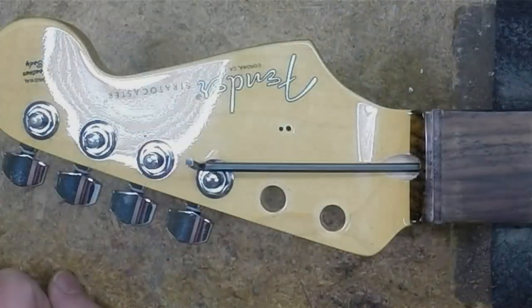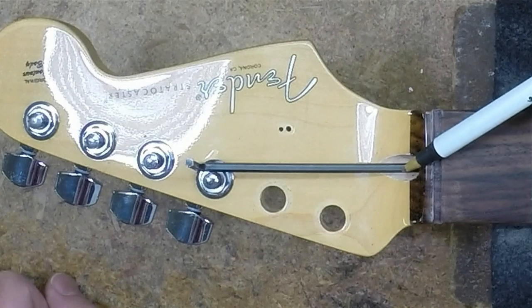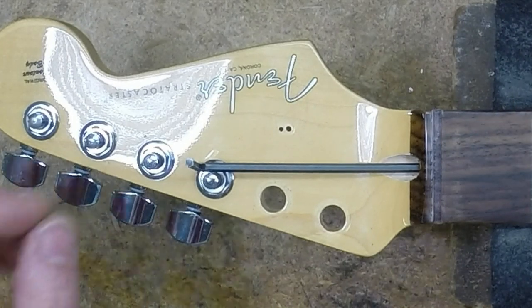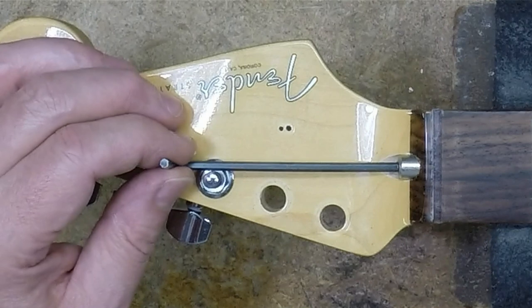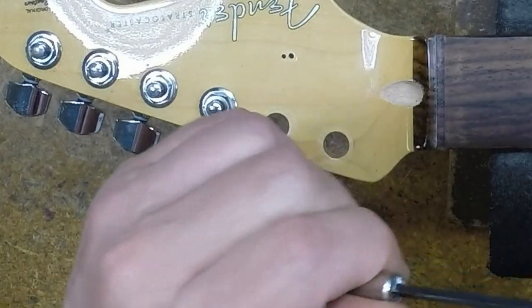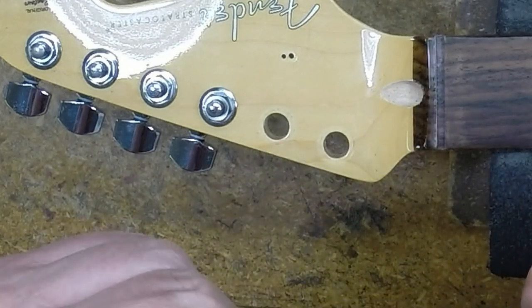Sneaky trick - I put a little bit of super glue on the end of the allen wrench and hit the nut with some accelerator. I put the wrench in the nut and gave it a few minutes to set up. Let's see what happens. Yes! Love it when a plan works out. So there we go. I can heat that up, get that wrench back out of there - and the nut, it doesn't matter, won't be using the nut anyway. But that worked alright. Now let's get on with the new nut.